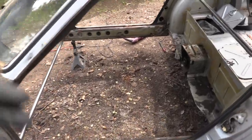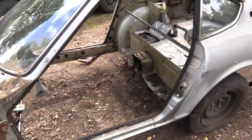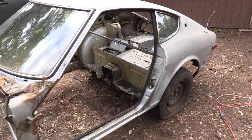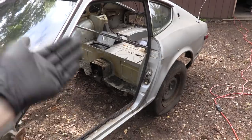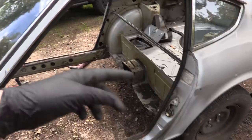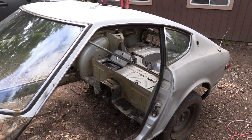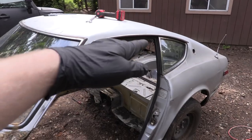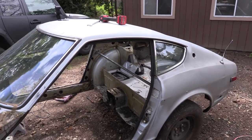Floor pan is out, it looks super clean. Look at all that room! Just last week you guys saw me uninstall a rear subframe the right way, and today we're gonna do it a different way. First we'll do some bracing — throw in the cross bracing — and then I need to find something to hold the body up once I cut the rear suspension away from it.